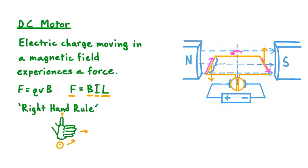These forces on either arm of the wire create a torque because we can see the axis around which our loop of wire will rotate, and these forces are not along that axis — they're separated from that axis by a lever arm, and therefore a torque is created. Now, we've only considered two of the four sides of this coil of wire. What about the front and the back? It turns out that for both of these sides, because the current points either parallel or anti-parallel to the magnetic field direction, the magnetic force on those parts of the wire is zero. So the left and right sides are the only contributors to a torque on this coil and the reason that it rotates.